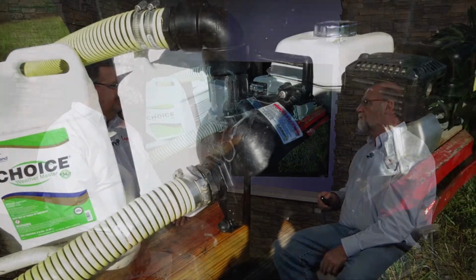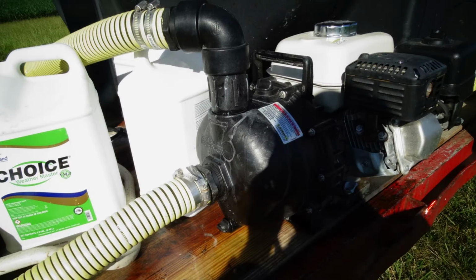And what's better than one? Two. And what's the thinking there? At the same time, here's an application where both of the clamps are at exactly the same position on the clock. But I would give them an A for effort. Two clamps, don't disagree with it. But I can improve on that, and what would we do? Here, you have them in different positions. So your tighten point is at different places. You're doing a better job in making the connection.